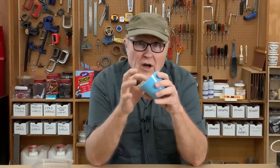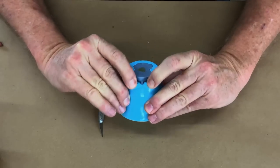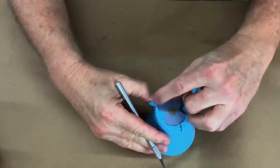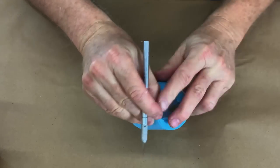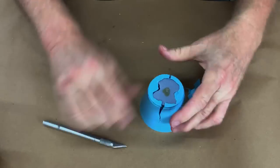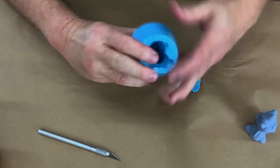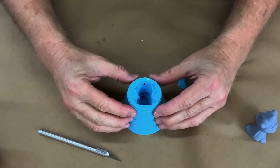I poured this mold yesterday. It's rock hard and ready to go — let's cut it open. You can see where I'm going: I'm going down to that arm right there. I need to cut through it, not just past it. That's a simple enough matter — just cut it far enough to release the part. The less we cut, the less we clean later, especially in production pouring. Coming right out — look at that. Beauteous! It looks super good, super clean little mold, and nice invisible parting lines. Very little to clean up.